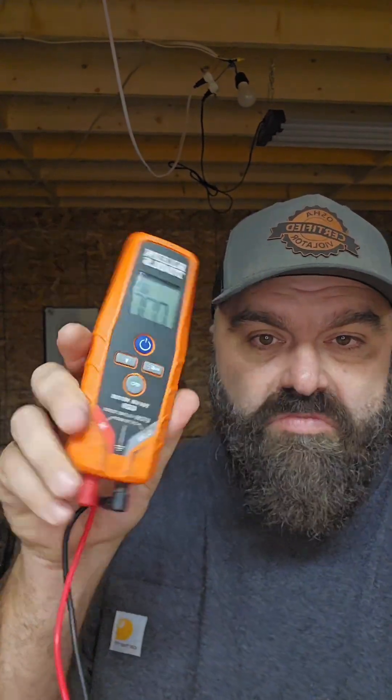So when I'm answering a question, I sometimes will say yeah, there's a difference there, but it has no practical purpose to electricians — something electrical engineers will detect and worry about. My normal carry-around meter in my bag won't even detect it. When you're dealing with electricity, anything can shock you — any connection can malfunction and present a shock hazard. Treat everything like a potential shock hazard during service work. But in a properly functioning electrical panel, the voltage difference between the neutral bar and the ground bar does not represent a shock hazard. It's not enough to shock you, not enough to power circuits, not enough to run a motor — it's useless to electricians trying to build functioning circuits in a home.